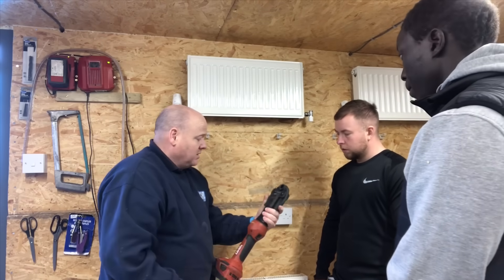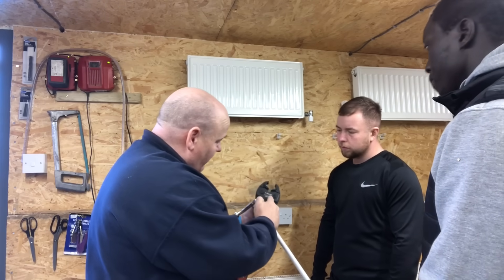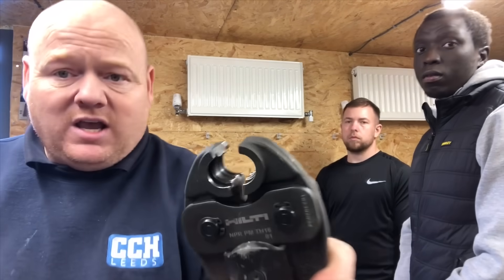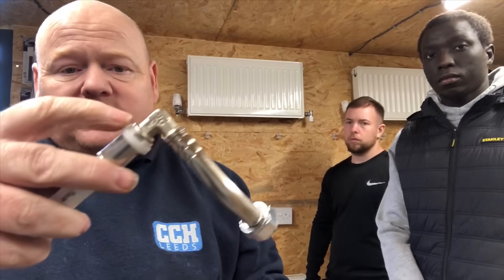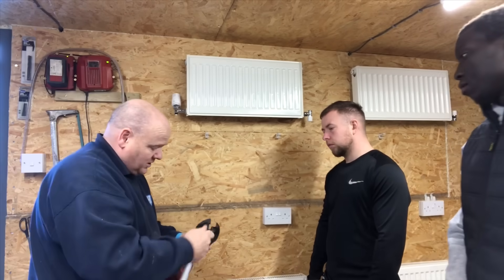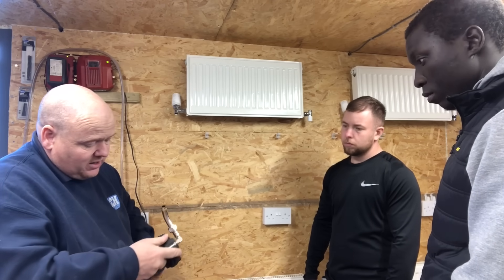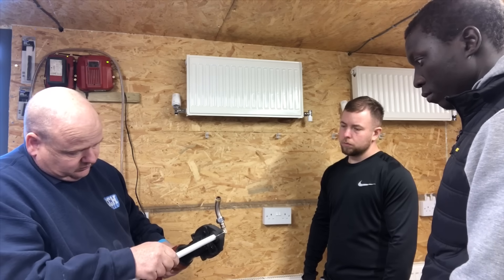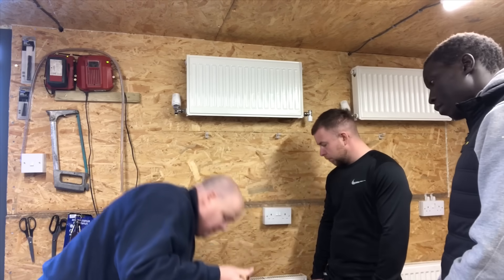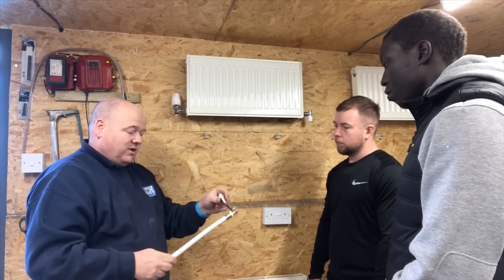Then what we've got is some jaws here — these are Hilti jaws. You have different profiles because this is a TH-16, and this is a 16mm pipe, so it's a TH-16 jaw. We need to make sure that this part of the fitting goes into this part of the jaw. Once that's in, we know it's in. Just press that — and that's it, that's sealed. So there's no mess, no muck, no flux going in your pipe, and it's a really strong fitting.